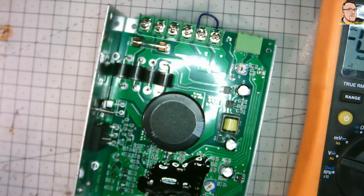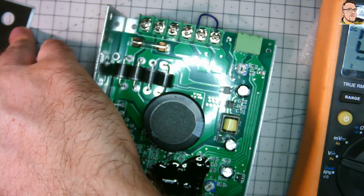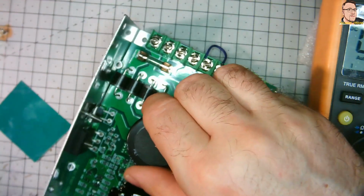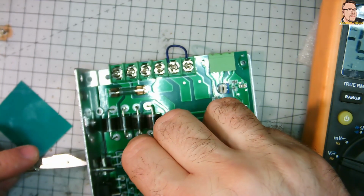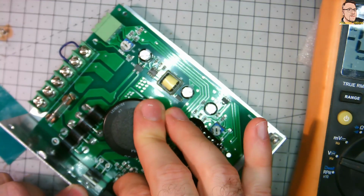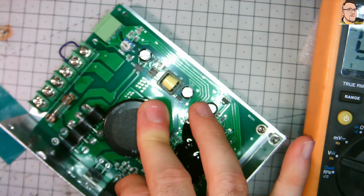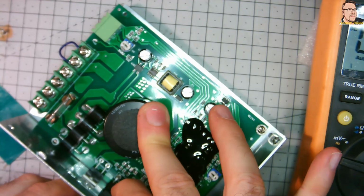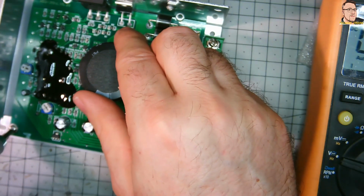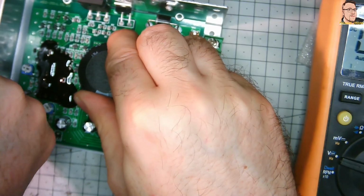And it is very important to always connect your shield, the metal casing, to the ground. It doesn't matter what device you're using, when it's connected to the grid, connect it also. Make sure your connection is there, even if you got a 3 pin plug, or many times on controllers like that, there will be a third screw terminal for the ground, but make sure this terminal is connected. A few times I found it was just floating, connected to nothing. In case something happens, that is the path where all the dangerous current and voltage will flow, and in the worst case, your fuse blows, or you will blow some component inside. That's fine, but it won't kill you, because the case is grounded.